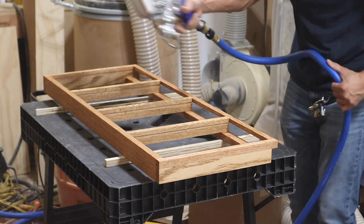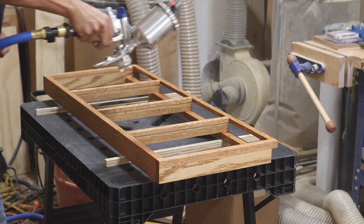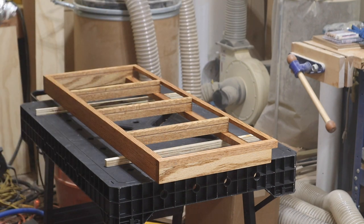Now, after the stain is dried for 24 hours, I'm spraying 3 very thin coats of a waterborne lacquer. I'm going to link all this stuff in the description below.